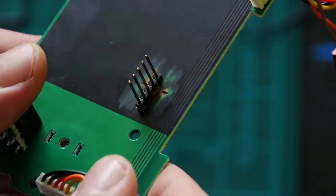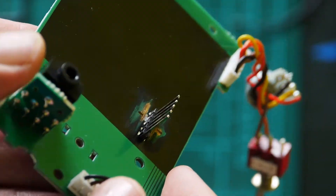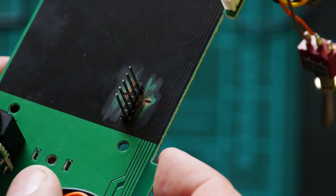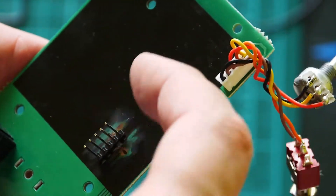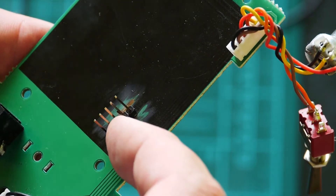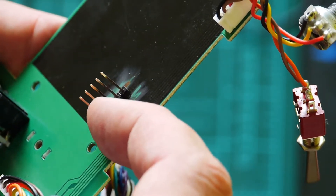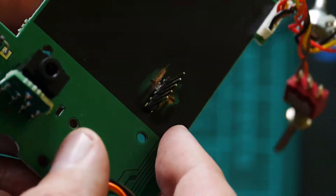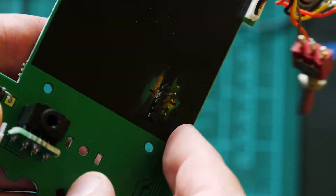So I'm done with this. As you can see, I removed the coating. I used a special tool in a Dremel. After removing the coating, I break the paths to pin number two from the top side. I count: one, two, three, four, five — pin number two. I know it's black on a black background, but I think it's clear.